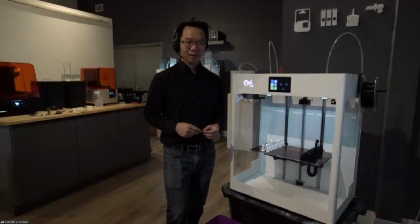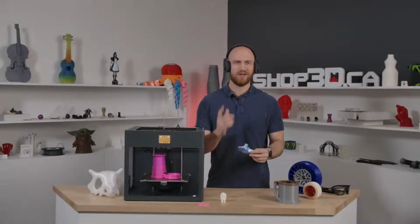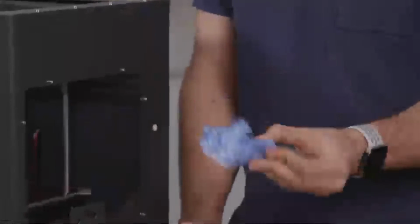Cool. Yeah, I'd like to add on mine. The print quality is pretty great. I printed PLA, PETG, and I think one poor part ABS somewhere near my desk. But the quality is good. Either way, I didn't have too much trouble getting it to stick. The layer lines look good. Even at the 0.2 millimeter height, I found it great.